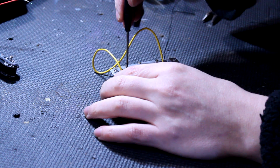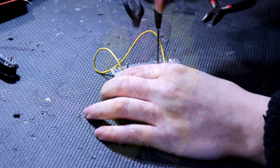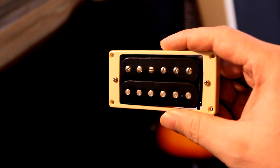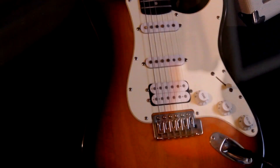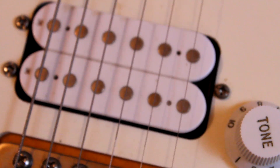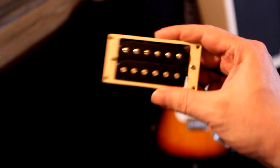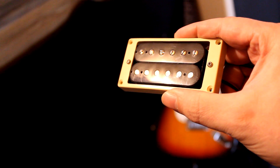Hello ladies and gentlemen of YouTube. I am Clementine and I am Super Saiyan. I was looking at an Epiphone humbucker and seeing that one coil has flat poles like slugs and the other has screws. This HSS Squier Strat humbucker has all flat poles — it's a dual slug coil humbucker. As a guitar player I suddenly wonder: what is the difference in sound between these two coils? I want to hear them against each other.